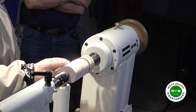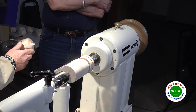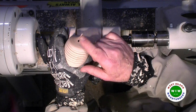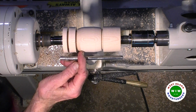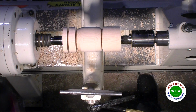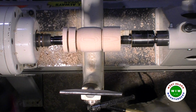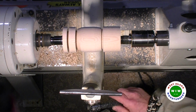I notice that I have more problems when I make the groove first, because here it is eccentric. When I make the grooves at the beginning, it was too hard for me to make the curve here. According to the magazine article, you make the grooves in the body first, then you go eccentric and make the nose. But you keep on running into the grooves that you've made. So this way, he's going to put the nose on next, put the face profile, and then come back and groove the body.